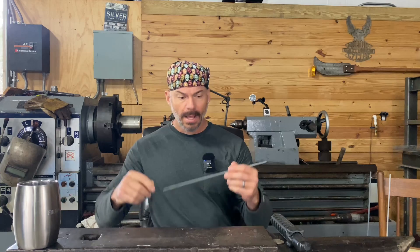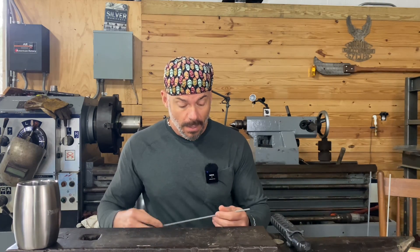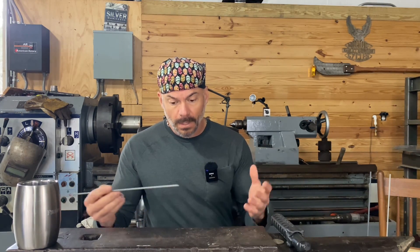Everything changes with different material, different thicknesses, and how hot the material is. If you're welding on pipe and you've already put about two or three passes on, it's going to be hot - especially if you're welding with somebody else. If your brother-in-law is on the other side of the pipe and you're about to cap it with a 7018, it's going to be hot on the bottom. You might let it cool off for a second. If it's real thin, you'll have to turn it down, but that'll get you close.